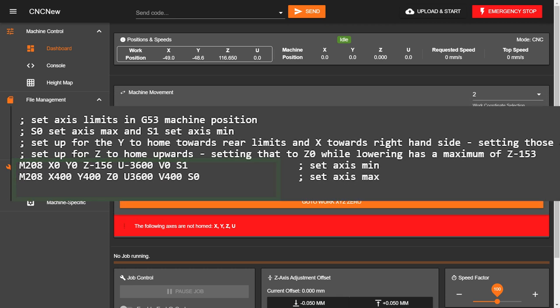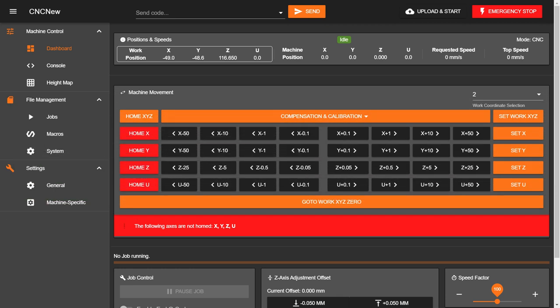If for some reason the limit switches are adjusted, this can have a knock-on effect on subsequent movements, work coordinates, and macros. In my case, the macros which would be affected include locating the stationary probe and the dual y-axis homing, which squares the y-axis to the x-axis.